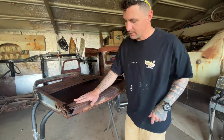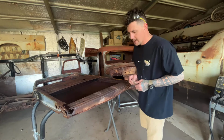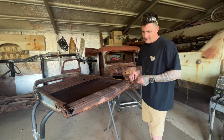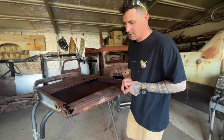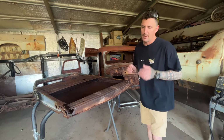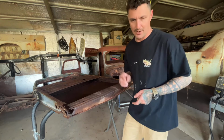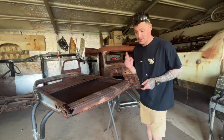I'll be hammer forming this top section, and then this bottom section is probably pretty simple. It's pretty easy. That will just require a nice little fold and a little bit of stretching on the stretcher. That's going to give it the curve. And a little bit of a tip there, that'll be just a straight line, I guess. Maybe, because we have curves this way down there, I may have to try and do the fold itself. But I am working with smaller lips, and smaller lips do come out really good on formwork. So that's possibly the way I'll go about doing that.